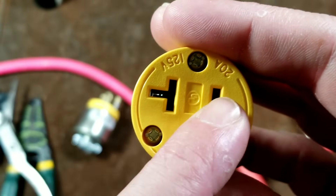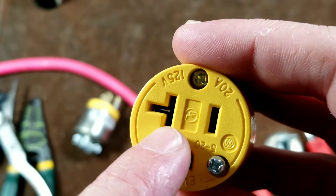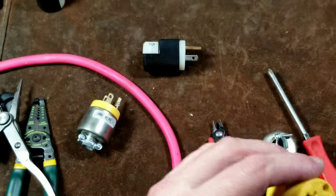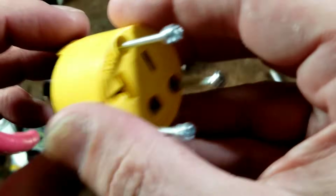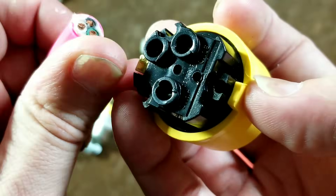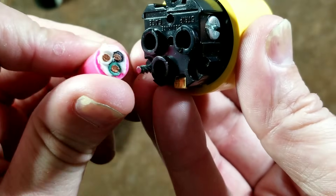The narrow is the black wire, known as the hot, and then the wider one is known as the neutral. What often happens is you'll pull off the end of the cord, and since we know that's the hot, that would be on the left-hand side. In this case, we want the black wire in the left-hand hole, the neutral in the right-hand hole, and of course the ground in the bottom hole.